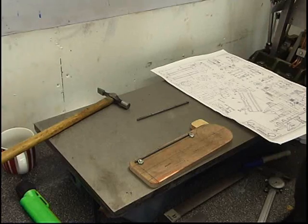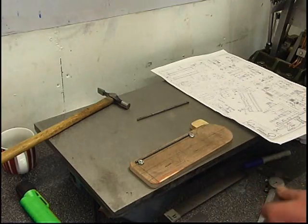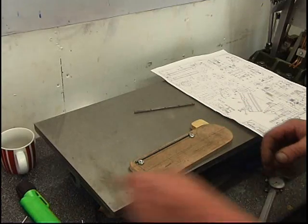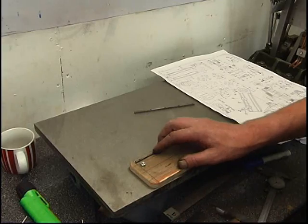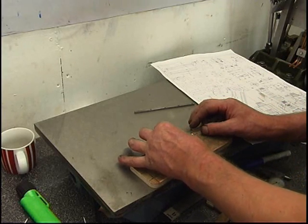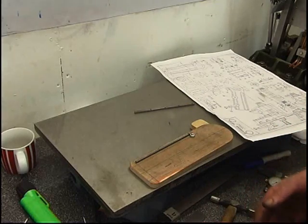In the drawing it specifies a 3/8 inch slot here with a 3/8 BSF bolt. I haven't got any 3/8 BSF bolts — I've got loads of 10mm stuff. I've got a nice brand new 10mm cobalt cutter to put the slot in, so we'll use a couple of 6mm nuts as spacers, which are 10mm. We're talking about a pattern here. People think casting's easy — it is, once you've sorted out making patterns. I'll probably make one and then find I can make it better, so I'll do another one.